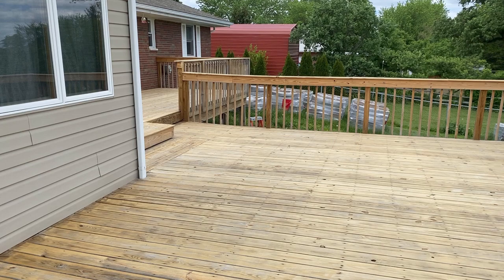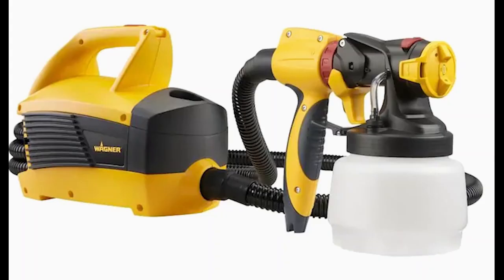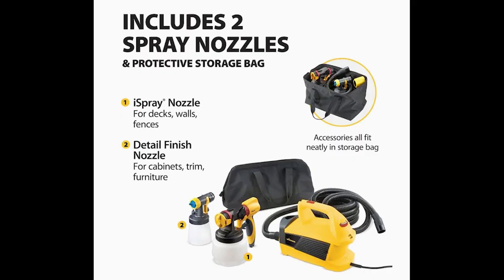Here's a before, a during, and here's the after. Now let's get into pros and cons. Pros: it's very lightweight. I actually enjoyed spraying with the heavier 45-ounce one — I felt like I had a little more control and volume. If I would have thinned out the stain a bit, it would have flowed better out of the fine detail sprayer. All in all, I was very happy with this unit. Cleanup is very easy — like they say, a five-minute cleanup. I did a more detailed cleanup and it took about 10 minutes. There are some nooks and crannies on the sprayer itself that took a little time.